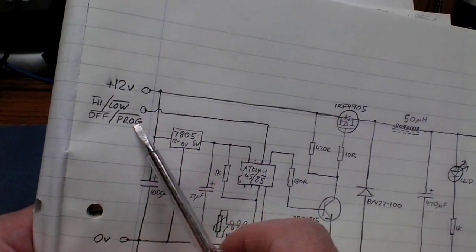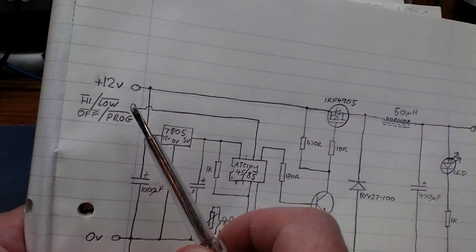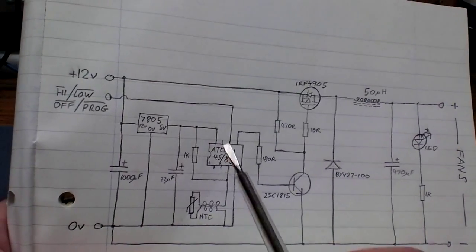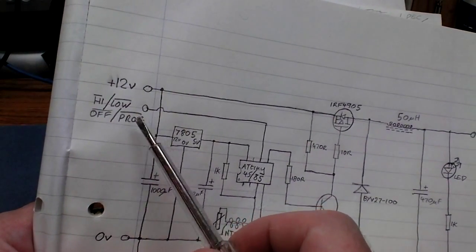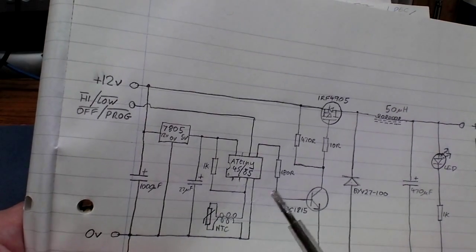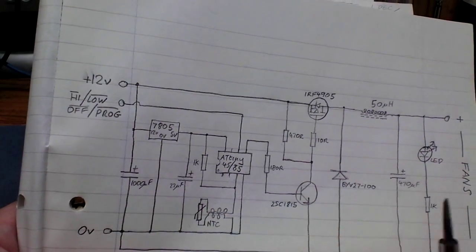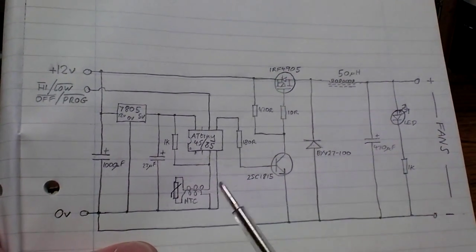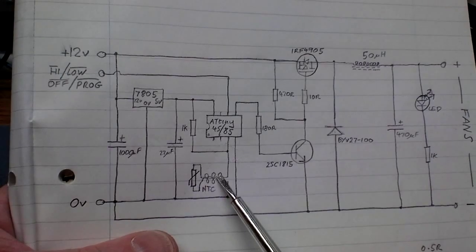Your signal lead, you only need one wire coming out. You can actually ground that. If you've got this thing common earthed, you can just ground that control wire to a pipe, so you've just got the one wire going to the switch that you can then tie onto a pipe. So you just pulse the switch and that selects your mode of operation. Same again with your thermistor.